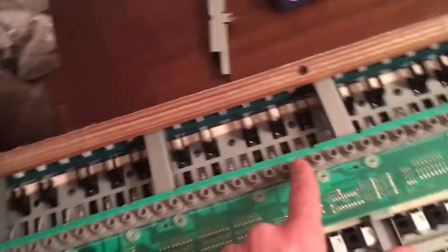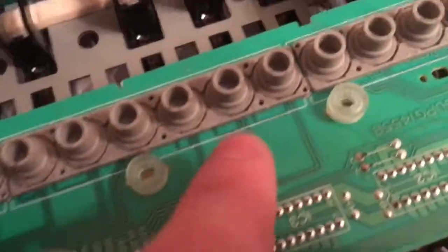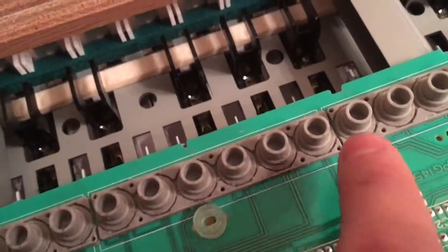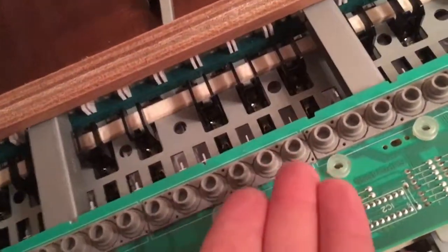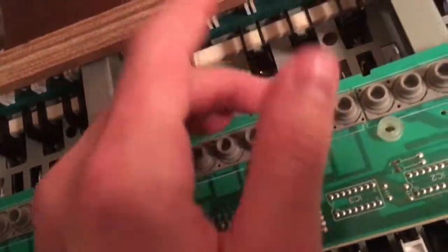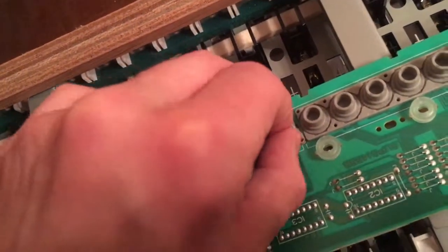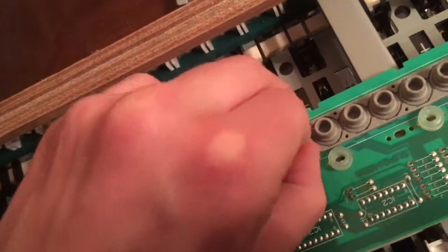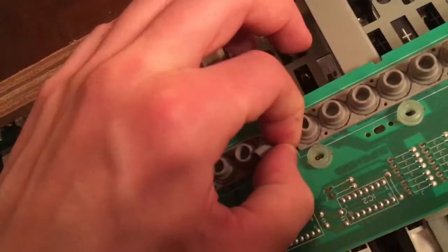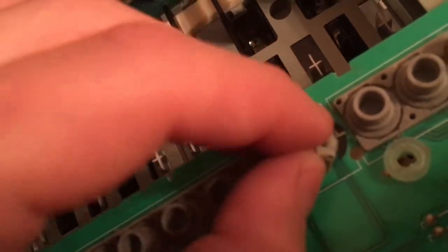As I was already thinking, it's one of the contacts between the boards, the rubber ones, because those are the most exposed ones, and they're usually the ones that get dirt first. It's actually kind of good, because they're easier to remove. So you can just unplug them, pull them. Those small rubber things on the back are the fasteners. This is a small fastener on the back. And there is the contact inside.